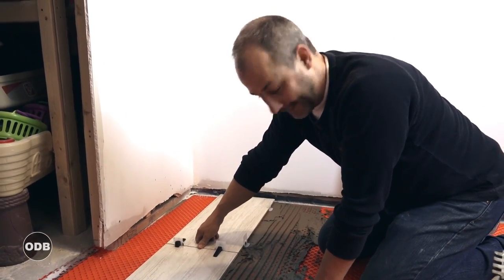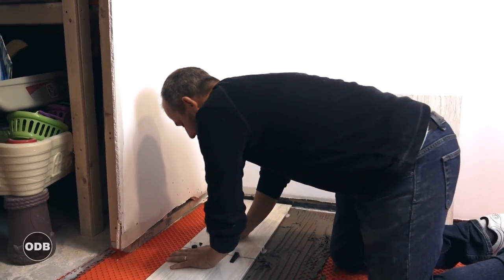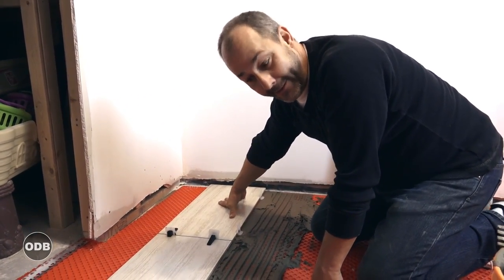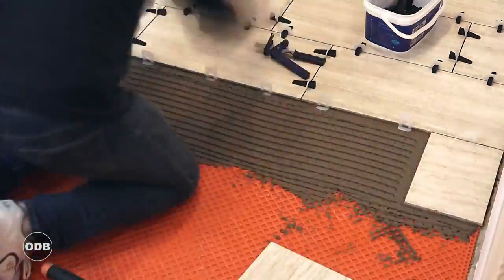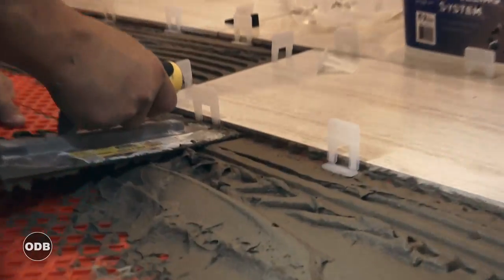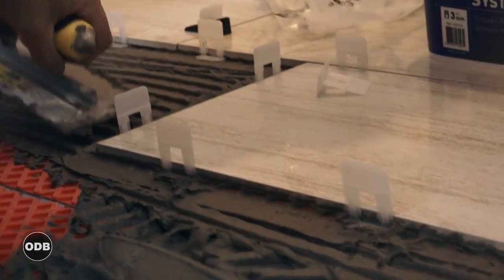The difference here is probably in nanometers — it's almost unfair to be sliding my coin across the tile. But honestly I am really pleased with how tight I can compress that clip. If you have the resistance, just use the edge of your trowel to force the base in — that's where the breaking point is on the clip. It's best to put your pressure there so you don't break it while you're setting it in.